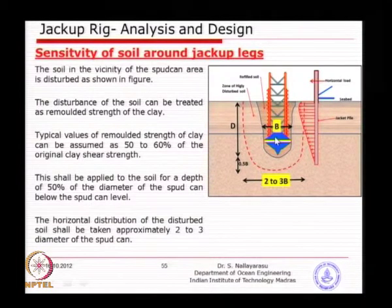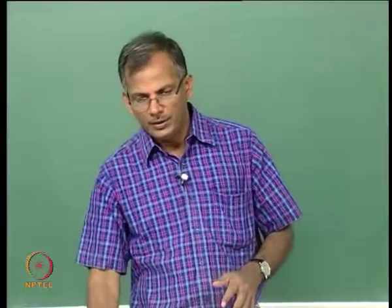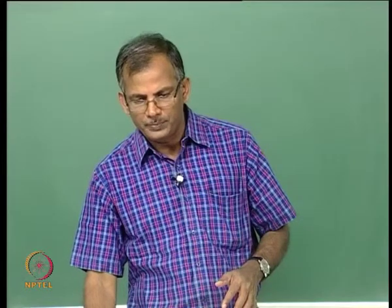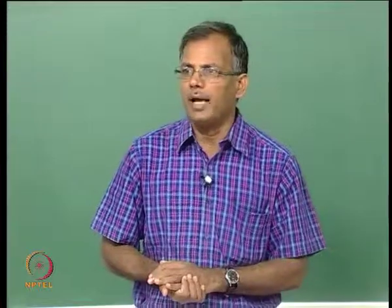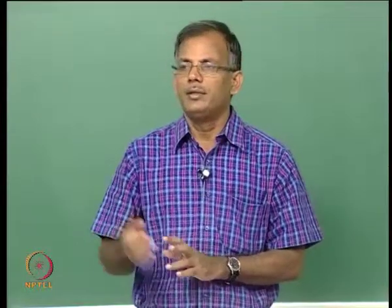If the different soil is very far, its effect may not be much important. Typically, from various literature — including HSE guidance — as long as the spacing between the spud can location and the pile is away from 1.5 to 2 times the diameter, the disturbed soil extends approximately 2 to 3 times the diameter of the spud can. So if you look at the distance center-to-center, if you limit it to more than 1.5 diameters of the spud, the effect of soil disturbance will be slightly smaller.